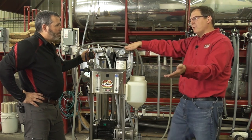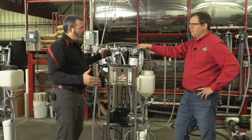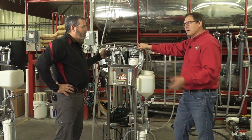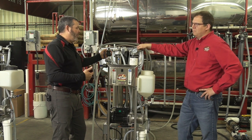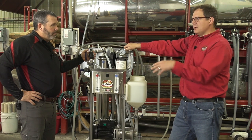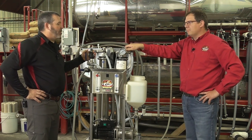Same process as soap — check pH the same way with pH strips or a pH meter. I recommend doing a citric acid wash halfway through the season and again at the end of the season. You can also let it sit in the machine for over a week, cycling the machine periodically — bring it up to temperature, shut it off, and let it sit. You can do that periodically throughout a week. The citric acid does not hurt the machine, and it's pretty common practice for most sugar makers to do that toward the end of the season.